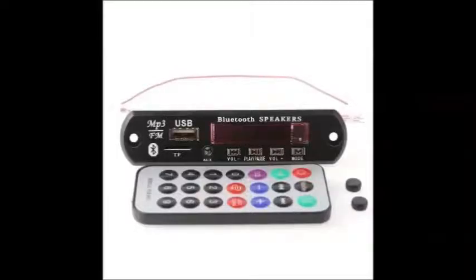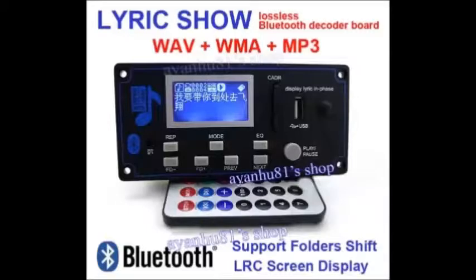Now the head unit that I have on it now, the Bluetooth decoder, I get a bad noise from the system whenever I go to Bluetooth or something like that. So I'm going to change it over with a newer one, and that one was $7, but I had it laying around the shop. This one's $18. Looks a little fancier, might not be, but it does have a diagram with it showing a bridge rectifier and a filter capacitor. Now, if it's not in the unit, I will make the bridge rectifier and the filter capacitor. I'll put that in line anyhow, so that should eliminate any hiss out of that one.